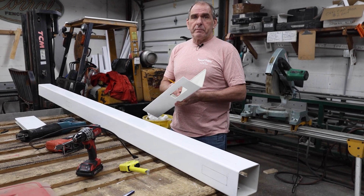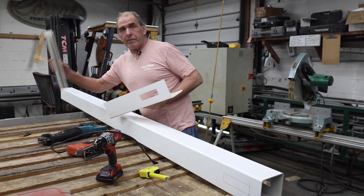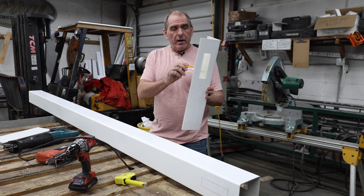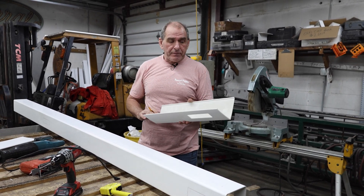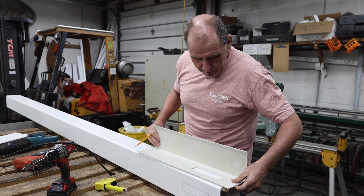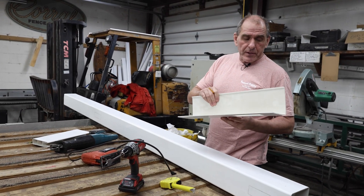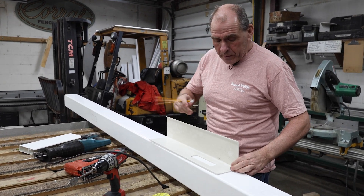Also, if you do a lot of fencing and use the same profile all the time — this is a one-and-a-half by five-and-a-half rail — what I have here is a piece from a garbage post with that hole cut into it. I just cut out a corner, so if I have to make a post on the job site I can use this. It's already lined up — I can just lay this down and draw my rectangle quickly. Usually I'll have something in the truck with every hole size just to quickly make a hole.